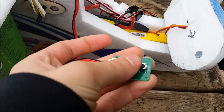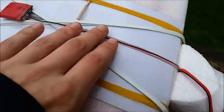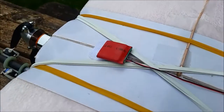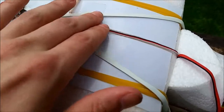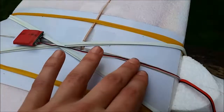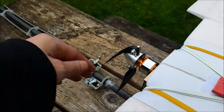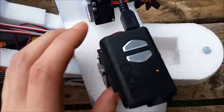I have the GPS set up to come out here, and there's just enough cable to reach the velcro. I have it like that for a reason — just in case the velcro comes loose. I'll lay down extra tape before a flight, but this way it's not going to come loose, fly back into the prop, and wreck everything.